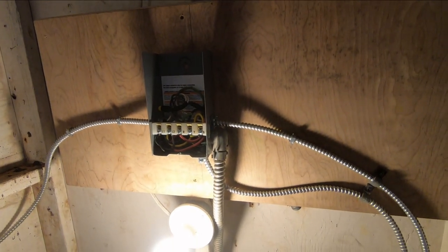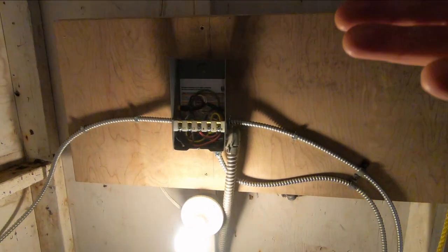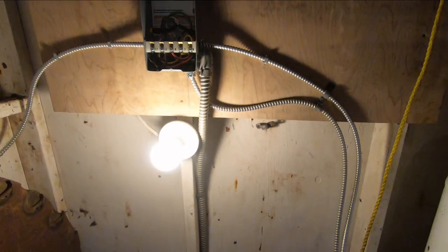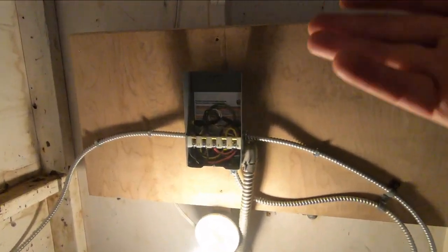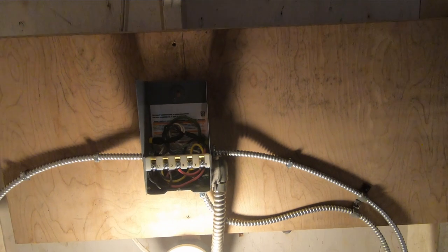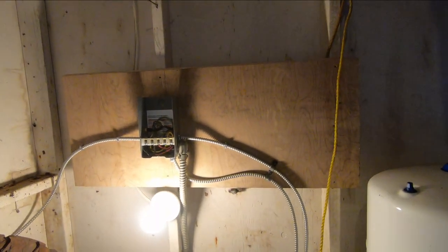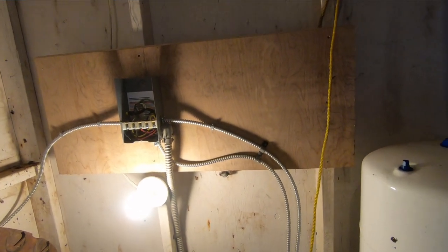Well, those are usually a cheaper pump, because if anything fails, if the relay fails or the capacitor fails, it's all built inside the pump down in the well. It's almost a throwaway. If one of these components fails in one of those cheaper pumps, you can't just change it here on the surface. You've got to change the whole pump. And that's why they're made cheaper. You'd think they'd be more expensive because they have all those components inside them, but it's not quite like that.